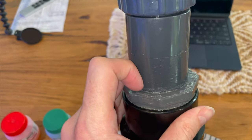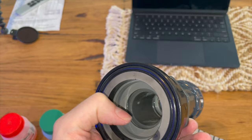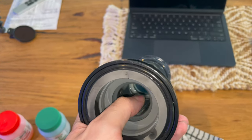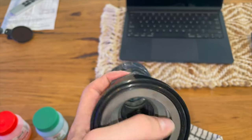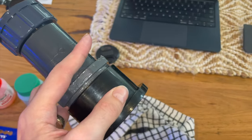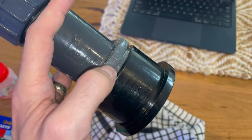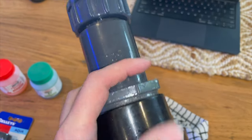And we think the leak was coming out of somewhere around this area here. So if we look on the inside, you can see that there isn't actually a join there. There's a conversion fitting. That's what this piece that my thumb is on right now is, a conversion fitting, which goes from whatever standard this part of the UV is, I think it's a US standard fitting or something like that, and converts down to a more reasonable size with this fitting. Then going into this fitting is a conversion to DIN standard, which is what all of my plumbing is.